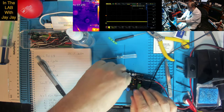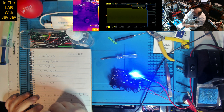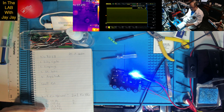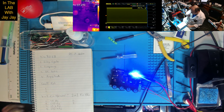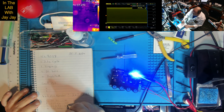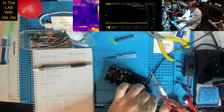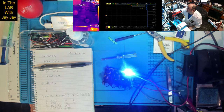And then we'll turn him off and we'll put him up here. And we'll turn him on. And that's 250 kilohertz. So let's say tens, hundreds, tens of thousands, hundreds of thousands. Okay, yeah, sure. So let's say 10, say 100, 1,000, and 10,000. And then the pin header. Let's turn him off, and we'll put him onto sine wave mode, and turn him on, and let's just see what we can do with that signal.